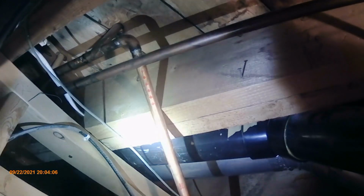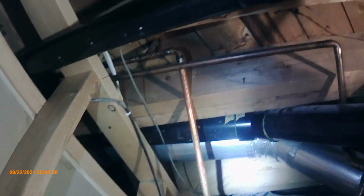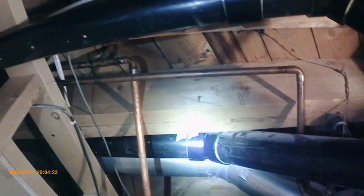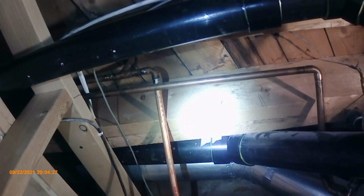In the furnace room, once again, we got 2 lines we got to cut now. Just leave that light off for now, maybe. We got your hot, and then the cold. And those we're going to cut. And then solder in a ball valve to PEX connection, 1/2 inch. And then for the bathroom, we've got some drains.